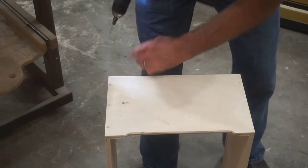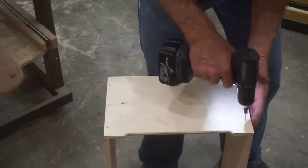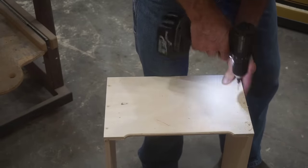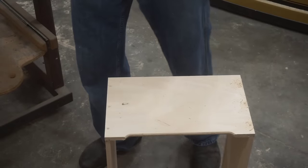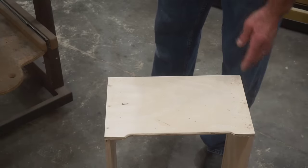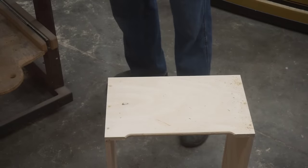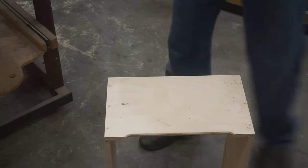When I take the drawers apart to sand them and lacquer them, I just label everything so it goes all back together the way I took it apart. For a run of 8 drawers, this is perfectly practical. If it was 800, it would be worth setting this up in a CNC to make these parts so that they would be universally connectable instead of specifically connectable like they are with my process.